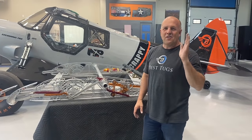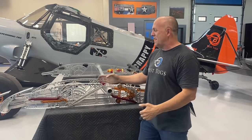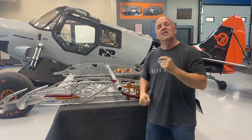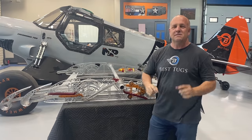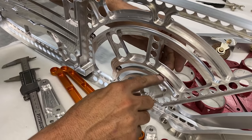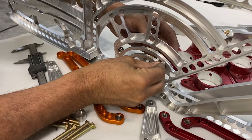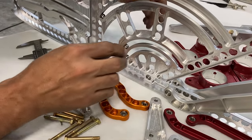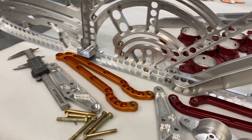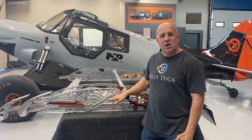So many little details I'll go into later, but guys, everything down to where is the deadhead stop? I don't want any bars bending. I don't want even a chance for a bar to get into a bind or a compression situation. So everything on all of these mechanisms has an overrun area. The bearings that insert into the tracks are actually outside of the travel of all the components. What that means is once you put the bolts in, you can't even get the bearing over to the location that slides it out. It also means that all tracks have a buffer of 10% more range each direction, so it can never bind. There are no added loads to these.